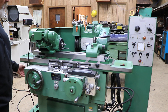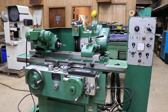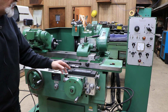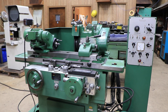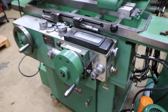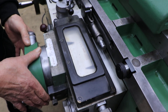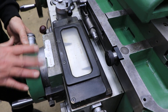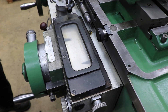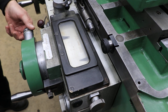Now when I start this, we're going to start our table to move. Our slide moved in, our workhead started. Each time we hit here, this needle is going to move down a little bit each time. When it gets to zero, the actual size is determined by the fact that you've already come in manually with this hand wheel and made your part manually the right size. Fine adjustments can be made later with this fine adjustment dial.